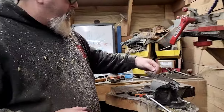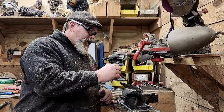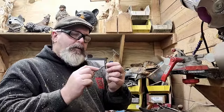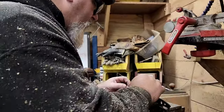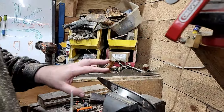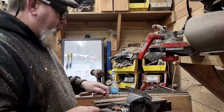Up here at the tip, if you have little dings or any nicks, get one of these diamond tools and get in there. You don't have to remove the nick completely — just knock them down so they're not raised, because what that's going to do is create havoc as it gets worse on the chain, the sprocket, and the bar.